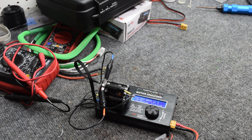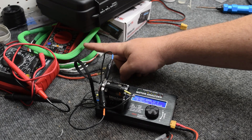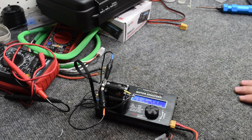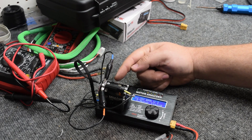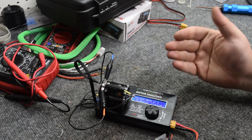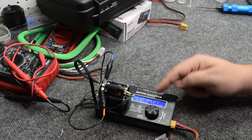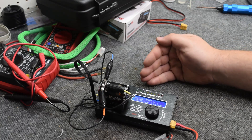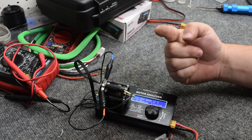Now that we've got you guys closer to the workbench, let's go ahead and get started on doing some tuning with the motor analyzer first. Video number three is going to be a poor man's version of motor tuning, and we'll get into that later. So back to video number one — setting your end play on your motor is probably one of the most important things I can stress to you. Getting it set correctly, because if it's not set, your numbers will become very inconsistent. That's why I started and was very thorough on how to properly tear apart and rebuild an engine the right way.